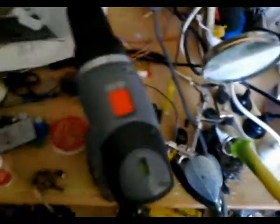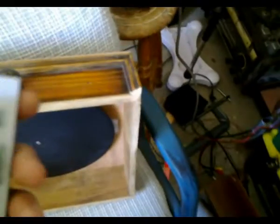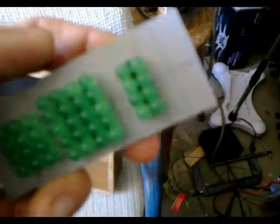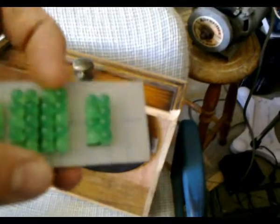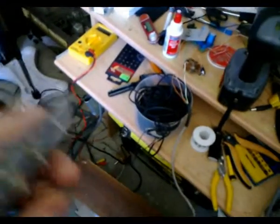So yeah, this is my latest video on this project. This project's really starting to take shape and I'm quite happy about that. Next, the job will be to get these LED banks mounted at the correct distance away from the diffusers and securely mounted onto the back of the scanning areas, and correctly positioned so that the spirals or holes go over the light areas perfectly. And then after that, add the video modulator driver circuit, and then start doing some testing and see how well this receiver actually works.